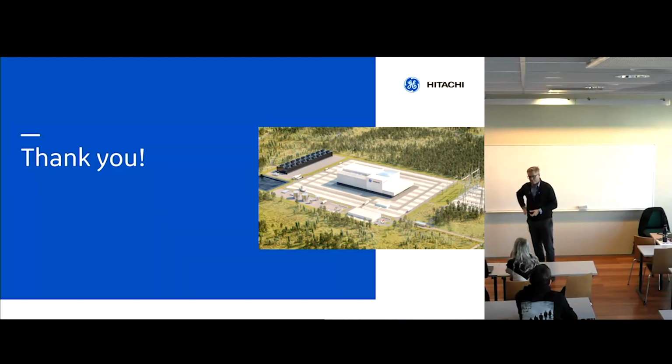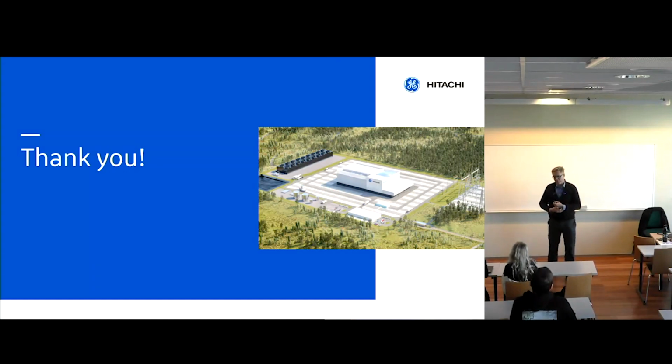During the first slides, you mentioned that you removed the core catcher from the... No, I removed the core catcher we used in ESBWR. It's not as complicated as the one in the ESBWR. The reason being, this is a much smaller core, and we have a lot more area, so we allow for a spreadable area with the refractory material, but we don't need the same type of core catcher that we use for ESBWR. Good catch. I mean, no pun intended, but that was a good question.